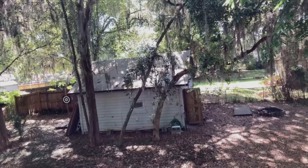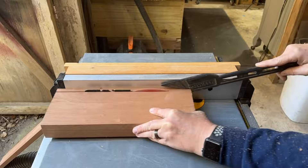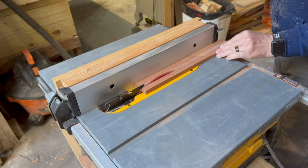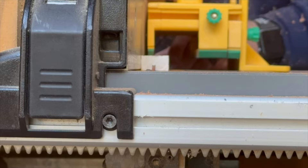I have a cutoff of mahogany left over from when I made the console table, and that's what I decided to use for the frame and the game blocks. I put a rabbet on all four outer frame pieces to create a lip for the bottom panel to sit in.